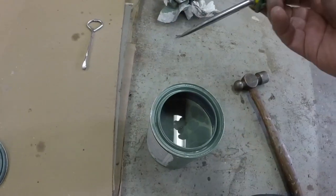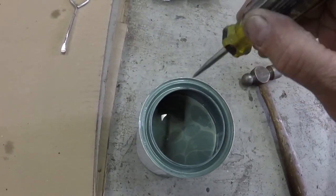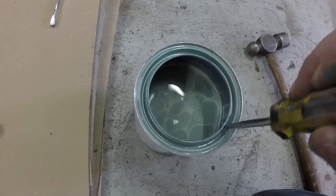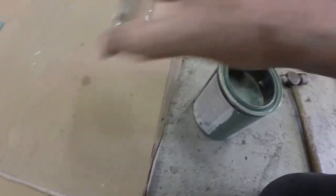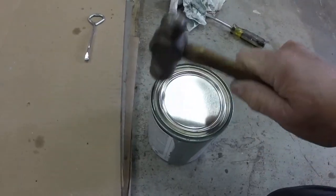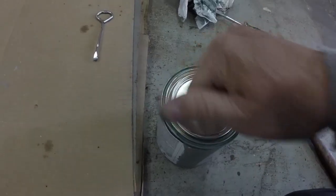How many of you do this? I take a sharp pointed punch and poke holes around the rim of the lid so the paint can drip back into the can instead of drying in the lid and making it hard to seal. You tap it down and it pushes the paint back into the can instead of squirting it out and filling the lip and drying the lid onto the can.